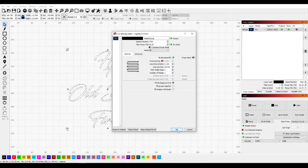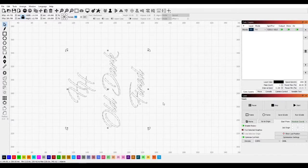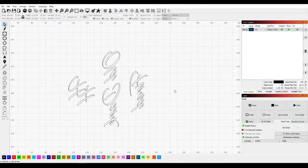We'll hit OK. We also need to turn this 90 degrees because it will be cutting sideways — we're actually going to go negative 90 so it sits this way. Then the last thing we need to do before taking it out to the machine is mirror it horizontally, because the rotary does everything backwards. This is exactly how we want it to be done.